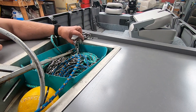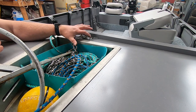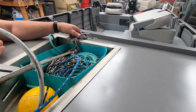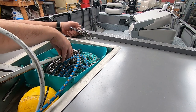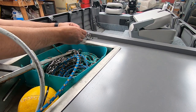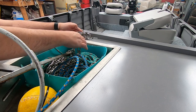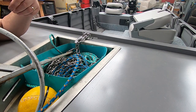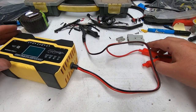All right so we've got the cleats all mounted. What I've also done is mounted this anchor point at the front, reinforced it underneath with a big chunk of stainless steel locked into the mainframe. All this does is give it a point where when I pull the anchor in I can use that as a hook-on point with a rope as well, but the main reason is so I can just quickly snap the anchor on and lock it so when we're traveling - if we hit something it doesn't go flying, especially on the road.